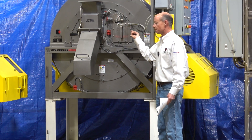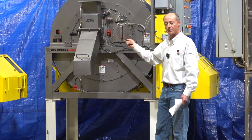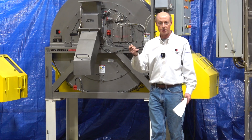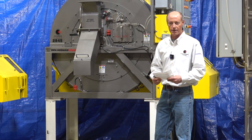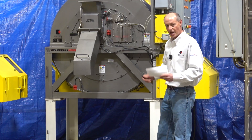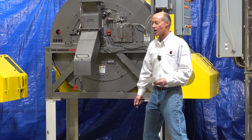Right here is our spray lance, and we spray liquids right down onto the product in free fall — that's where free-fall processing happens. Free-fall processing happens in the Mark 6, 7, and 7-1, where we have a cascading free-falling curtain of product to receive liquids intimately and exactly on the product as we expose the surface area. We have done tests with hundreds of products this way and have never had a customer tell us they've found it done a better way. It's an excellent process to evaluate if you're looking to put powders onto granules, or liquids onto powders or granules.